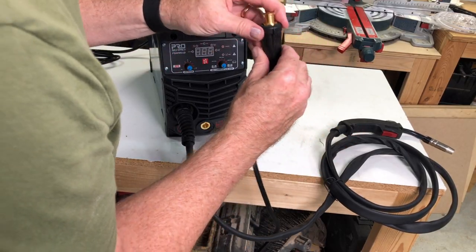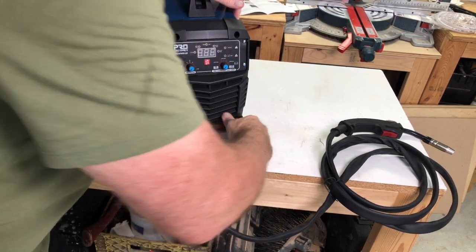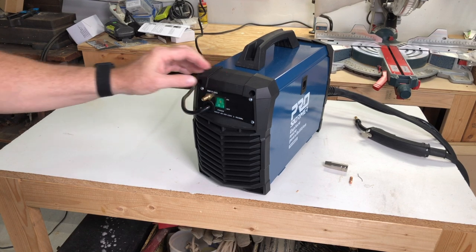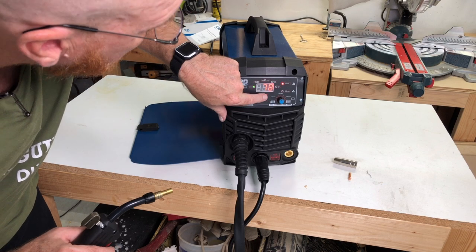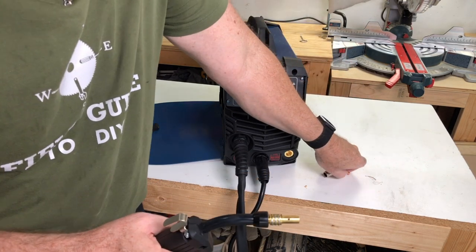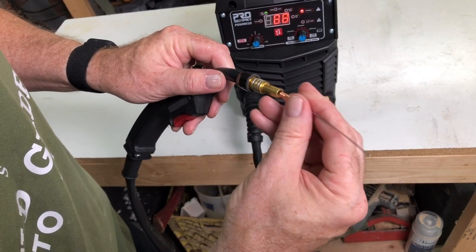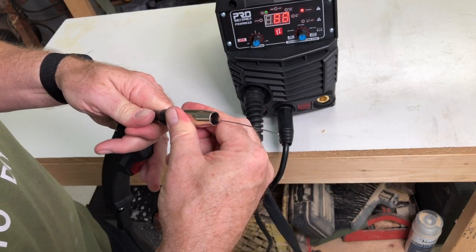Attach the earth cable to the machine at the opposite polarity to the inside. Remove the gas shroud and with a small spanner unscrew and remove the tip. Toggle through the different modes — that was on stick; put it on MIG and when you pull the trigger that's where it feeds. Press the feed trigger of the gun and observe the wire feed mechanism. Pass the tip over the wire and secure it back onto the swan neck — do not over tighten. Re-secure the gas shroud and trim the wire back as required.